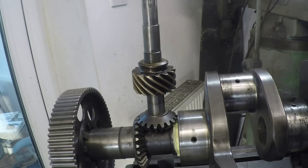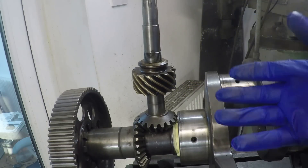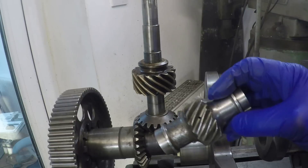These skew gear failures had started to increase as early as 1941, particularly after the introduction of 100 octane aviation fuel, which enabled them to run more boost and obviously the engines were making more power. The significance of this wasn't really apparent to them at the time, but they started to have a look at the form of the teeth and the finish — they weren't actually grinding gears at this point in time, they were machined — so they put better quality control onto both of these gears.